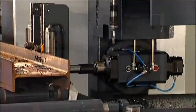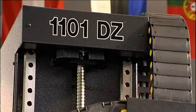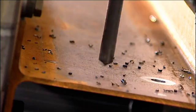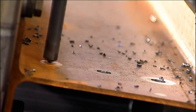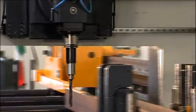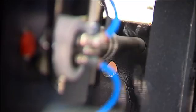The massive drill head central to the design of the Orient 11 features a ball screw precision feed to utilize today's high-performance tooling, such as carbide inserts, in a most productive fashion. These carbide tools feature drill penetration rates that exceed those of high-speed inserts by four to five times. The high rate of feed in conjunction with the spindle drive that develops 2,500 RPMs reduces the required tool pressure and generates small drill chips rather than long spirals typical when drilling structural steel with twist drills.